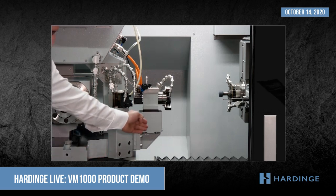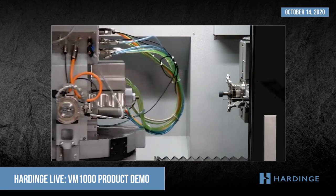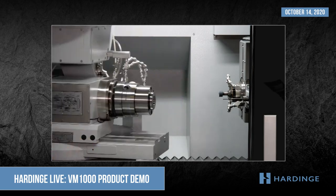And look at this. There is so much space around the dressers. It's difficult to get the collision there. Another highlight is the enormous swiveling angle of the B2 axis, which gives us a lot of flexibility. For example, to place measuring devices around B2 and to reach the workpiece changing position in the left of the machine, where also an automation cell can be placed.